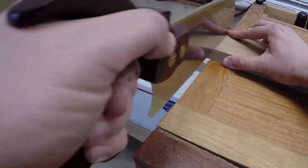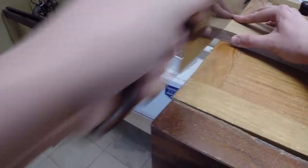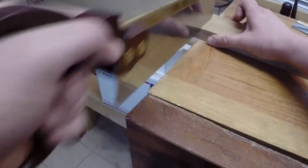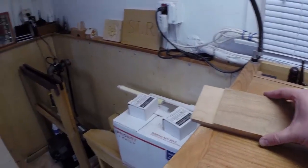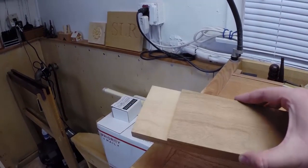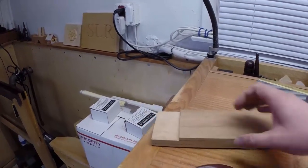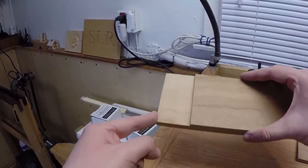Now I'm going to cross-cut out the shoulder. I've already got a cross-cut saw, right? There's my tenon cheek, and there's half my tenon. Look at that cut — it's perfectly clean. This would be joinery ready. I'm right on my line all the way around the tenon. Perfect saw cut. Didn't need a dedicated tenon saw for that. Certainly we're not able to do that with the average dovetail saw because this tenon is too long.